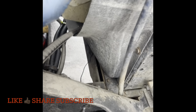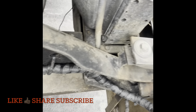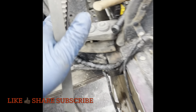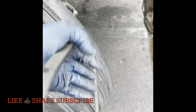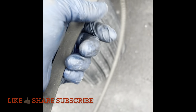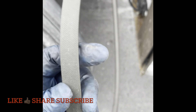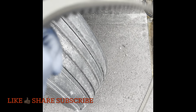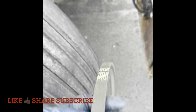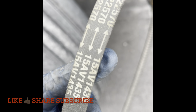These two are gonna go on the bottom — watch the fan though, you don't want to mess the fan up. Those belts don't look too bad. What I usually do — if it ain't too bad, I'll put the belts back in the package and put them under the bunk. It doesn't look too bad, but since I changed the ones on the top I'll change these anyway. There are no cracks in it but I know they're worn, so I'm gonna change them anyway. Make sure you remember the part numbers on these belts.